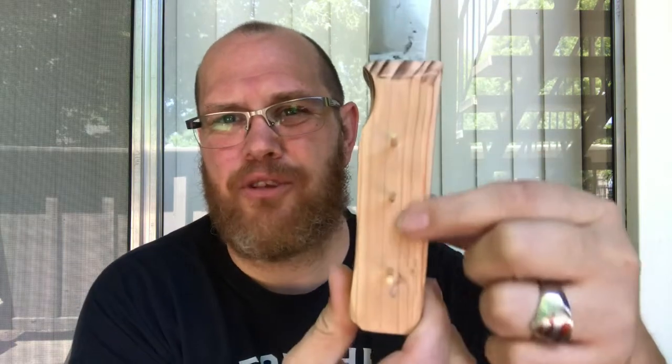Also in the last video, we shaped the handle. I drilled the holes for the pins. So now in this one, we're going to cut that handle in half. I left the epoxy too far over there for me to reach, but I have some. We're going to pin and epoxy it, and the belts I ordered showed up, finally. So we're going to work on the polish of the blade first, and then I'm going to cut the handle in half. We're going to epoxy it, pin it, and then start shaping it, and hopefully in this video, I can get this done. That's the goal, so let's get started.